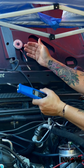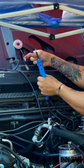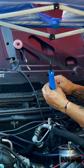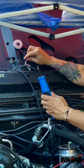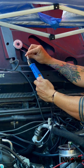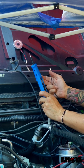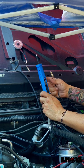That's as easy as it is. Now say you want to test continuity — say you have a length of wire and you want to make sure that wire is connected to where it's supposed to be. You've got the same wire that you're testing for; you'll take this little alligator clip — say this is one side of the wire — and then you'll take your other side and be able to test for continuity and make sure that wire is connected. That's it, that's as easy as it is.